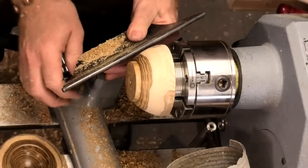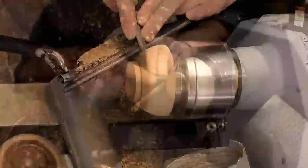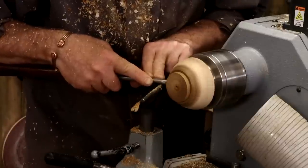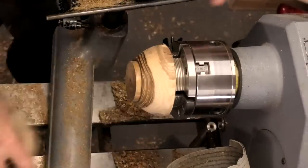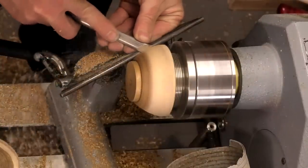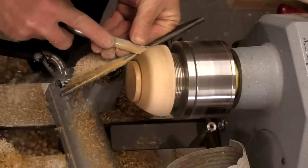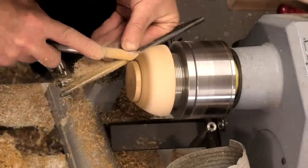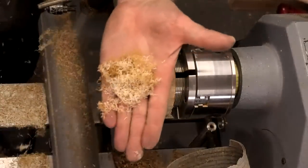Looking up, changing the body grip a little bit with the left hand. I'm going to go to my skew — just want to find this lightly. I'm tilting it — this is a lighter cut than I can achieve off the gouge, this is actually the shear cut. I can work either way with my rounded section on the bottom. That skew should slide along the tool rest nicely. Carefully trying to pick this up — look what we just cut off. Isn't that lovely!